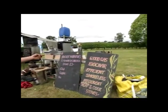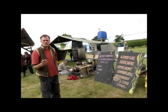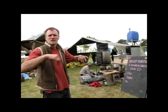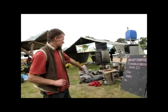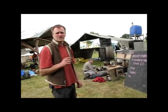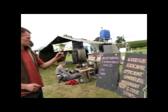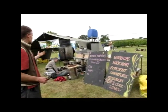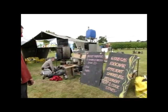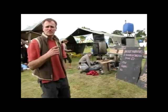We've done little workshops on wood gas — producing and using wood gas. Instead of combusting, we're using pyrolysis of the wood chip, which is depriving it of oxygen to make a very smoky fire. We're burning the smoke separately in the inner combustion chamber, and we're producing biochar. I'm an organic farmer — that's what I do for a living — in an area of sandy soil and high rainfall, and I want biochar. These stoves burn the wood gas to produce biochar. They're very efficient. You can see how smokeless they are. Efficiency and smokelessness go hand in hand.